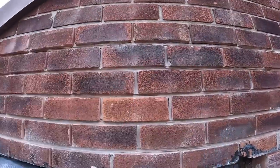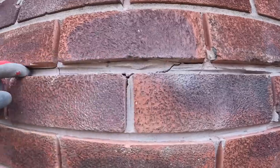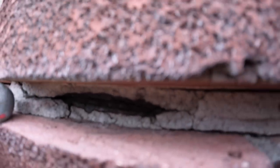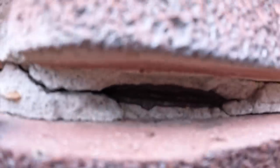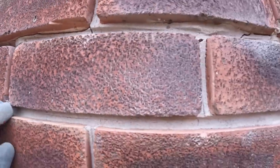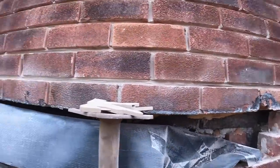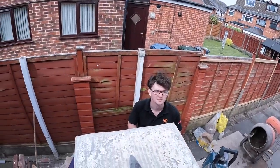That section's all ground out. Just a quick one here, this crack isn't caused by settlement, this crack is caused by rusty tie wire. As you can see there, rusting away and blowing, so it's lifting the brickwork. That's going to be protected once I've gone back a good 15mm to get this jointed up, pointed up. So the next stage is the cavity tray, so I'll just ask my glamorous assistant to join me up on the scaffold, please.